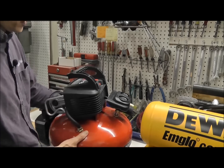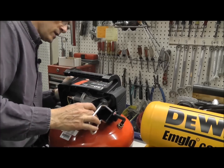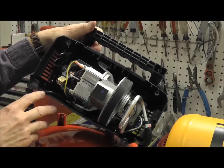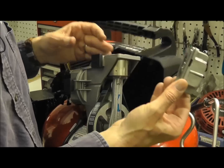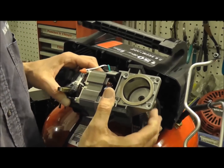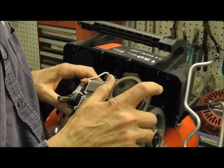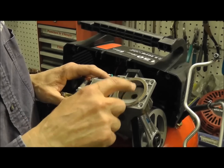This is what you're looking at inside of one of these air compressors. This little baby pump is what they call a pump — as you can see, this particular pump is very small. The motor windings are exposed. I've taken the head off, and you can see you have valves inside here, some gaskets. But look at the size of the piston and the cylinder — it's using a Teflon-style ring. It's an oil-free unit, does not require any oil to run. But any kind of sand or grit that gets into this air compressor is going to wear this cylinder and this piston ring out.